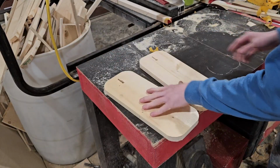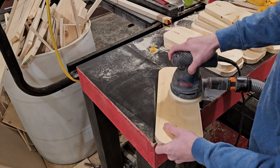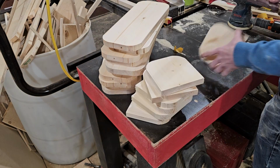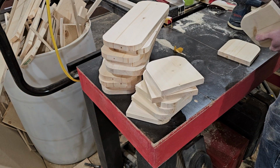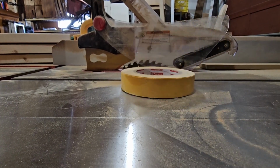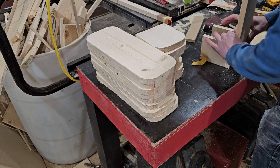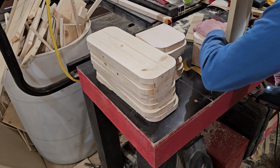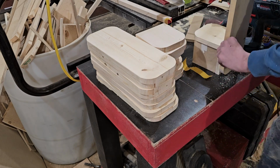Now I sand each of the 19 pieces, first with my sander and then a little bit by hand to curl those edges. All with 220 grit, I think. I don't think the plants are gonna care if it's not perfectly sanded. And using my double-sided tape and setup jigs, I assembled each of my shelves, 3 screws in the back, pre-drilled with a countersink, link in the description for the drill and the tape, and all the other tools that I may have used in this video.